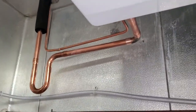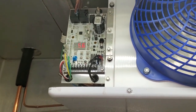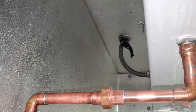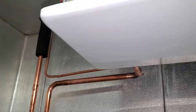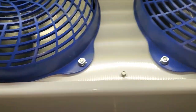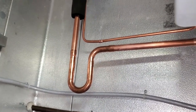We're all piped and my coil is running. We got power turned on — I know that flashing is just the frame rate. We're all hooked up electrically. We still got to clean up a lot of stuff. We used the existing penetration from the old line set because the refrigeration lines were on that side, so we'll just seal it up. We drilled the new penetration here, and we actually used the hole from the old electrical for one of the bolts, then we'll seal that up too. I'm going to go up on the roof and get the nitrogen flowing and then we'll come down here and braze this.